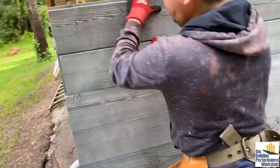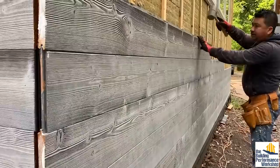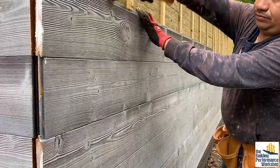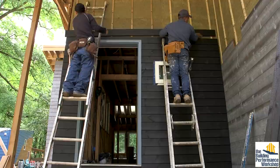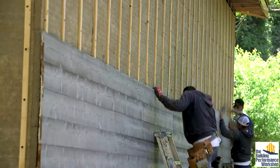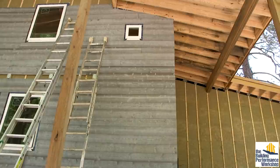What that cooking at 419 degrees does is take the cellulose out. The cellulose part of the wood is the food source for bugs and fungus. What it does with that cellulose is basically transform it into lignin — that's the other main part. The lignin is like rebar; it's providing a lot of structural strength for the wood. And it's not going to be edible. So the lignin both gets strengthened — what's already in the wood — and you destroy the walls and turn what were cellular formations into long rebar-like formations. That adds to structural stability and also increases moisture resistance, so if you get the wood wet, it hangs onto moisture a lot less because it doesn't have the cellulose anymore.